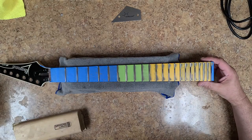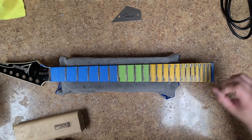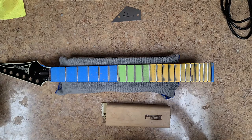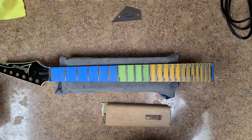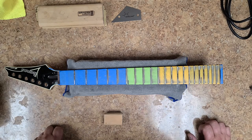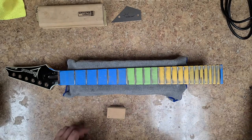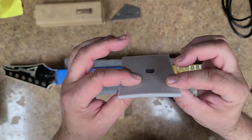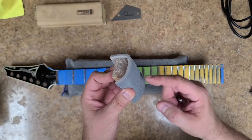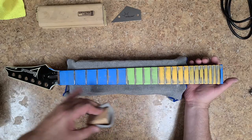They are pretty much done — barely see the line over here on these guys. So I'm stopping there, not going any further. That's using 220-grit sandpaper. Now I'm going to go to the next step, which is crowning these guys. My crowning method is a little different than what you've seen before. I bought this little block — it has these rounded pieces of metal underneath. You take this foam sandpaper pad, wrap it around the block just like this, and those humps sit right over the fret and round off the fret, crowning them at the same time as polishing them.